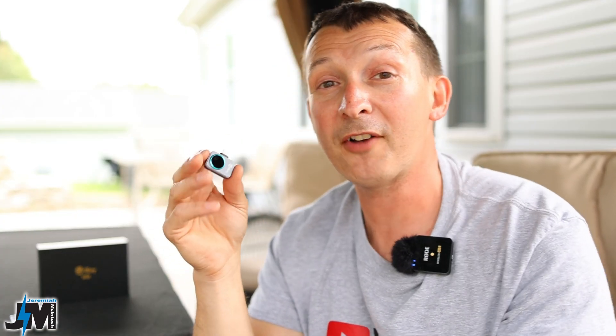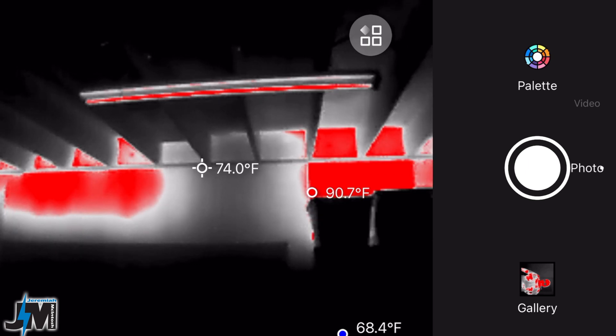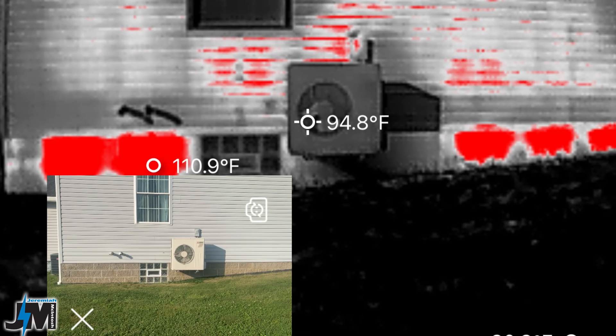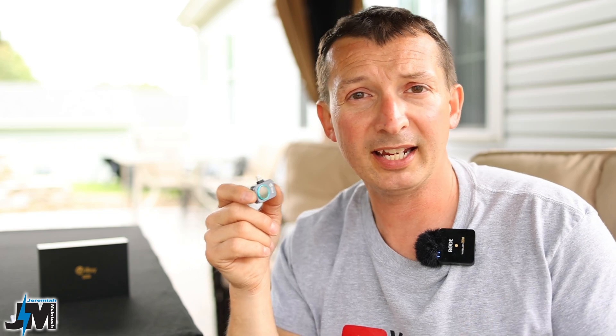I did test this out in my basement and what I found was really cool — you could see on this clip that the floor joists and the band board running around my addition were pretty hot, and in the winter it's really cold because I need to insulate that yet. But right in the center there was a spot that wasn't anywhere near as hot as the two ends. Right on the outside of that wall I have a mini split with a fan constantly blowing, which was keeping that wall cool — showing right here as a gap between the two red spots. When it's really cold out I'll be able to see where all the cold spots are and where cold is coming in, which should help me with efficiency once I get those areas insulated.